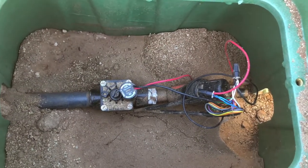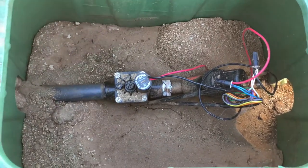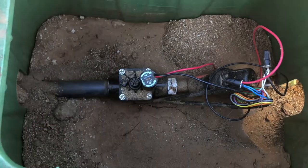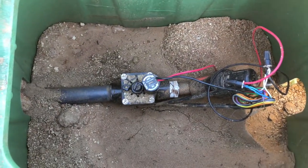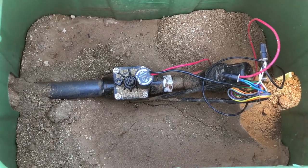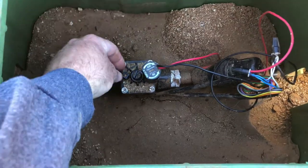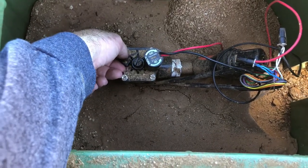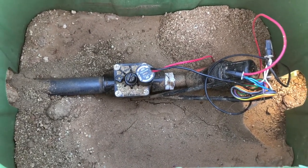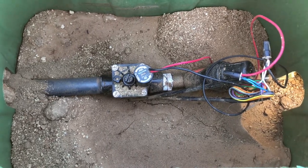We're here at the troubled valve — the one that was complained about. If it won't shut off, first check the solenoid and make sure it's tight. On this valve, the solenoid was open, which was bypassing it and keeping it manually open — tightening it shut everything off. If the valve still won't shut off, open the air purge screw on the back. Something may be jammed inside; this will help clear it. It may take about 10–15 seconds for the valve to completely shut down.